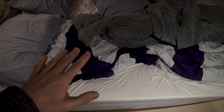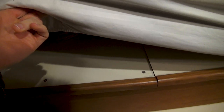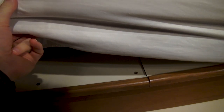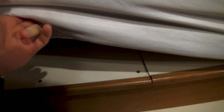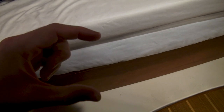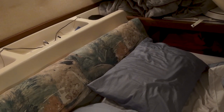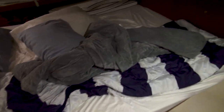As we sleep, our bodies give off humidity and moisture. It gathers in the mattress and because the mattress has nowhere to breathe, it condenses on the bottom against that flat surface. So I purchased this foam gap material online — it's almost like an interwoven plastic lacy material that looks like a really large Brillo pad, with lots of air gap for air to pass through. The one I purchased was either three-quarters of an inch or one inch thick, and both are marketed for boats and RVs to use underneath the mattress for better airflow. This bed is almost a perfect queen size, a little bit curved, so I did order a queen size and that should be coming in a couple of days.